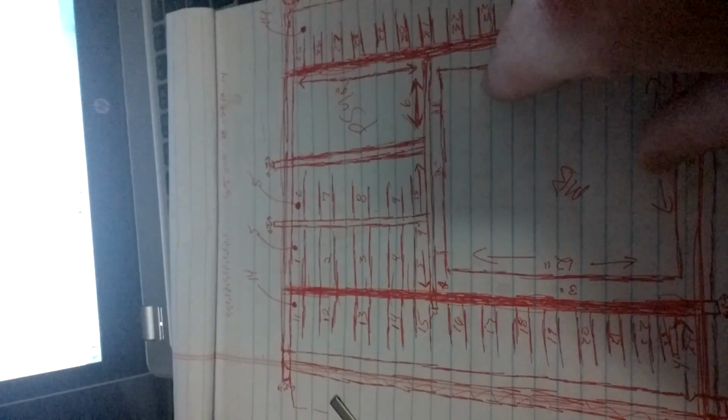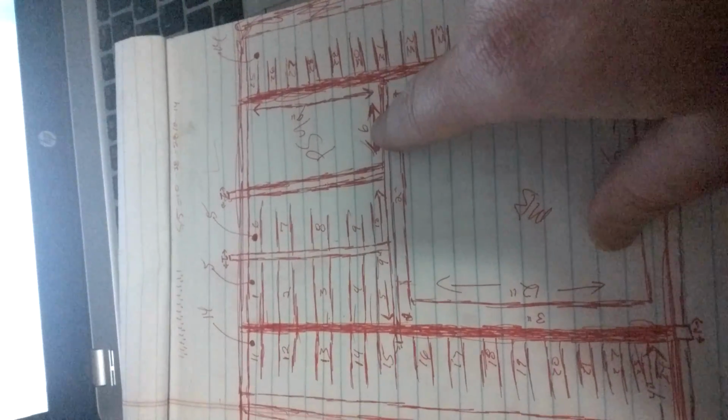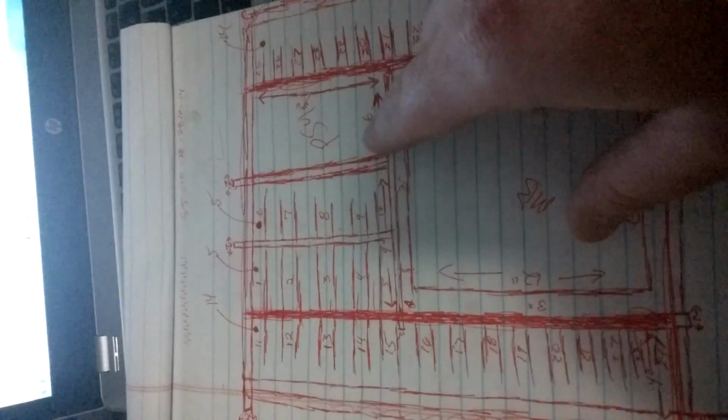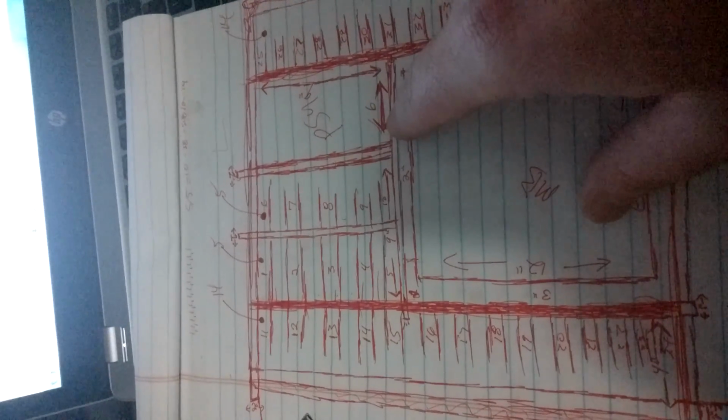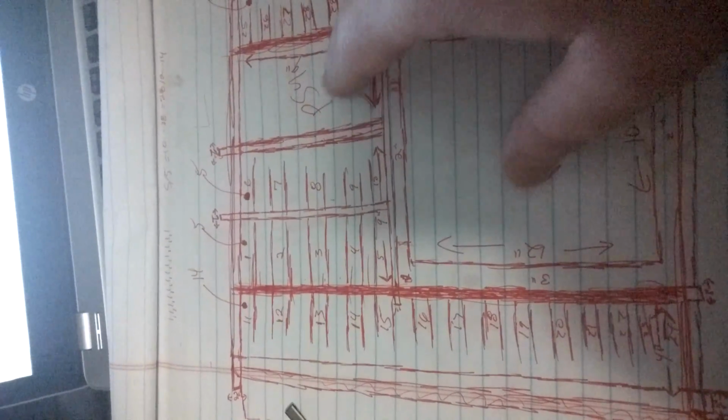The thing is, other than the 14 that are on the board, these are all going to be powered from the PCIe cards, which I'll get to in a minute. And those are going to be powered by the Molex connectors. So that means we're essentially pulling 200 watts from the 12-volt V1 rail, which is a hard ask on cheaper power supplies, because they don't tend to put a whole lot of power there. The way those rails are set up is for the PCI Express, the video cards, the 8 pins, the things that normally pull power.